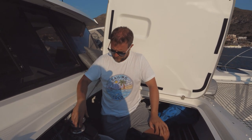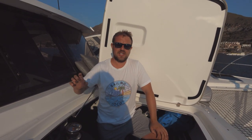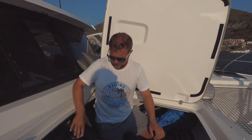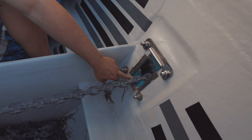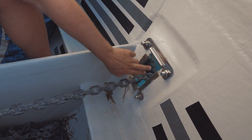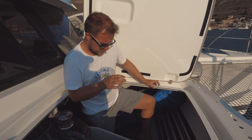We have our windlass, 70 metres of chain, and our Rockna anchor — 23 kg, the biggest one we could get for the shaft length. With the Manta swivel it didn't impact the windlass at all, so it's the heaviest we could have gone — one or two sizes up from what they recommend for the boat. We reinforced the outlet with stainless steel plates that my granddad made, because when the chain comes up it bangs around and chips away the fibreglass. We also fitted anti-slip tape just so when it's a little bit wet, you've got a bit of grip.